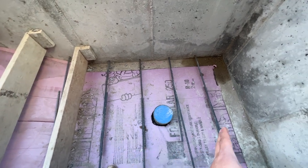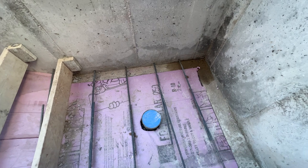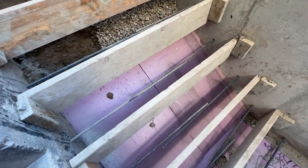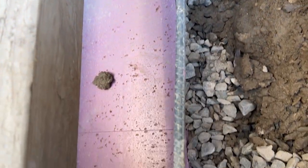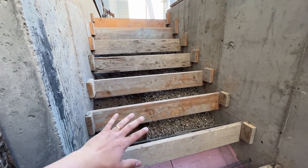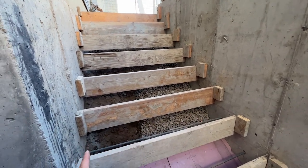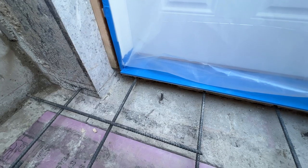Because this rigid foam board is pretty soft, we have to put rebar in here 12 inches on center — it's actually even closer than every 12 inches on center. Moving on up the stairs, we have rebar dowels — number four rebars, half-inch — in every single stair going all the way up. That's going to ensure that if the soil underneath the stairs ever settles even a fraction of an inch, the stairs are going to be supported completely by the rebar dowels on every single step on both sides.